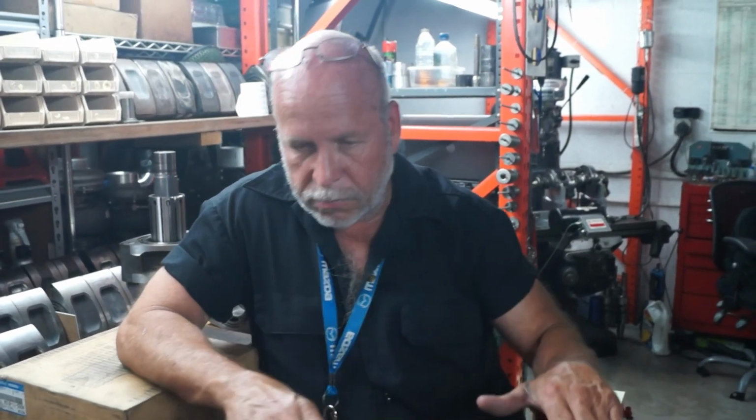engines have logged 360, 370 hours of racing and practice, 3 seasons of running. Take the engine apart and the rotor housings are like brand new. So yeah, on an endurance engine, naturally aspirated, definitely 3 mil ceramic. No two ways about it. Turbo engine, depending on the boost level, I'll consider whether 3 millimeter is required or not.